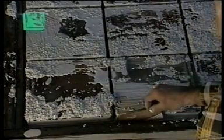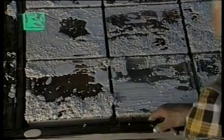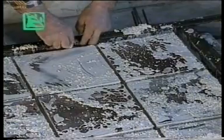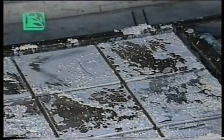At the same time, you place 4 pieces of reinforced iron on the 2 opposite sides of the frame, 2 on each side at 1/3 and 2/3 of their length. These wall hooks can be used to carry the wall and later to anchor it. They are placed on the outside of the frame and are marked with pieces of cardboard, which will be used to identify their position when the work is finished.